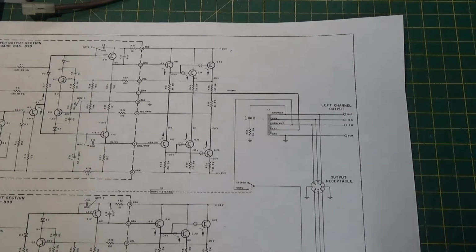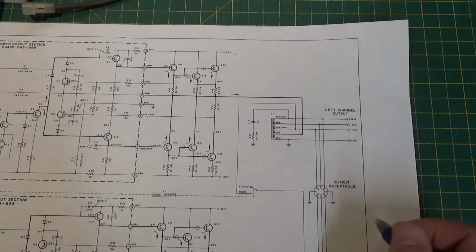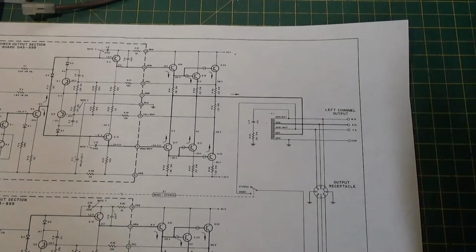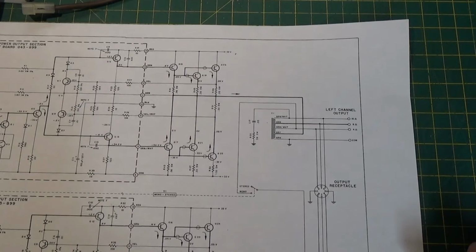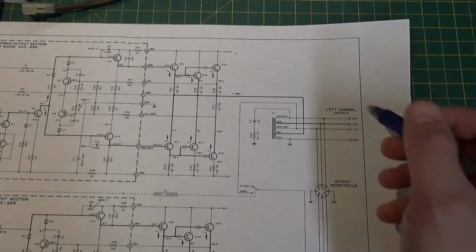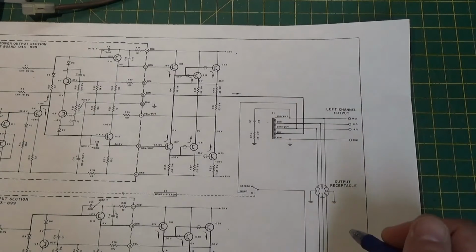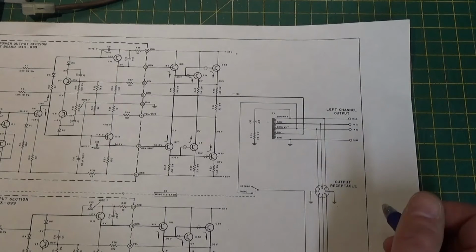And the difference is, McIntosh says, it's 100 watts and I don't care what you hook up to it. Anything that's a 4 ohm, 8 ohm, or 16, we got it covered. It's always going to be 100 watts maximum. That's it. So, why would I want to do that? I'm cutting my power down then, you're telling me. I mean, if I can get 180 watts by hooking up a 4 ohm speaker to a regular amp, why would I want to buy this thing and only get half of that if I hook up my 4 ohm speaker?